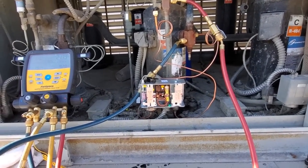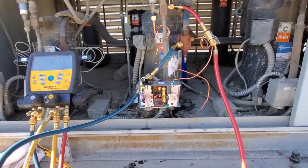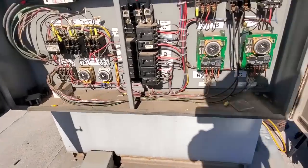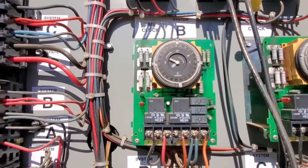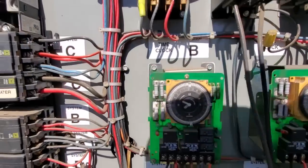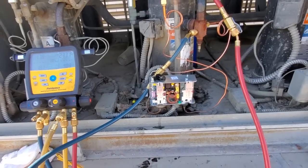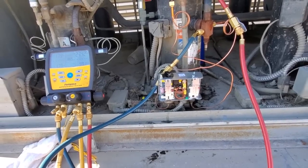So the box is still just not getting cold enough. But what happened last night — likely — is the box actually pulled down in temp quite a bit, because the product in there that has been in there all night is frozen. But the air temp in the box is still in the 30s. It ran until it went into its first defrost, more than likely. So it's not that the system won't run — it's just that once it pumps down and shuts off, it's going to have a hard time coming back on. Thus, why the product is frozen but the air temp is high. The temperature in the box is warm enough to bring the pressure in the system up to turn on the pressure control, even if it was set at 30 PSI. 30 PSI is a little bit high on this control.